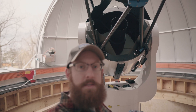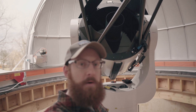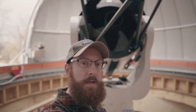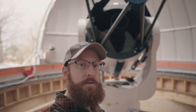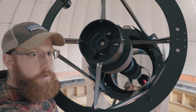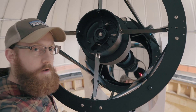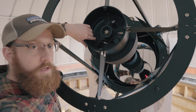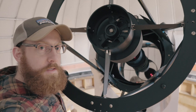I've taken all four leaf shutters and attached them to the actuators. Now I'm going to open up and remove the covers over the primary mirror. From there, I'll attach the laser adapter onto each port and check that the laser is returning on center. Looking down at the primary mirror, you can see the light returning and bouncing back onto the target — it's just a little bit off. I'm going to adjust the tip-tilt just a little bit to bring that laser light back onto itself, onto the target.